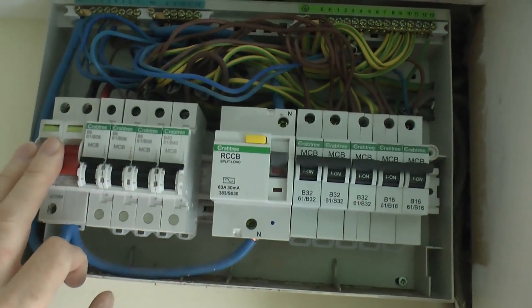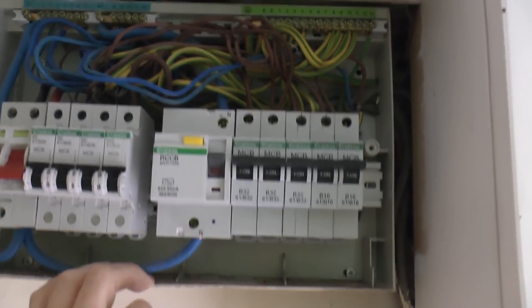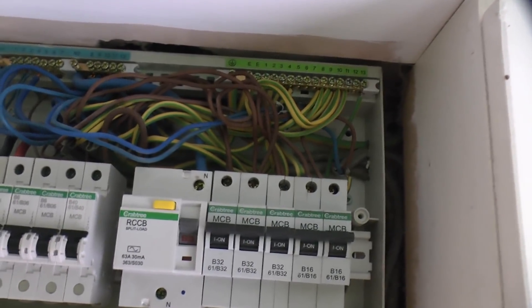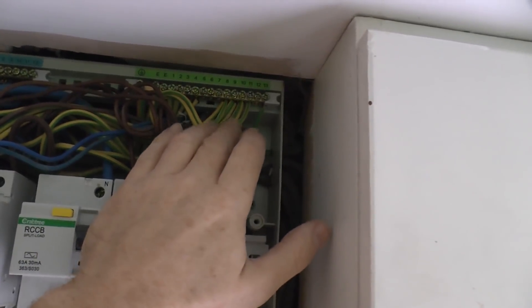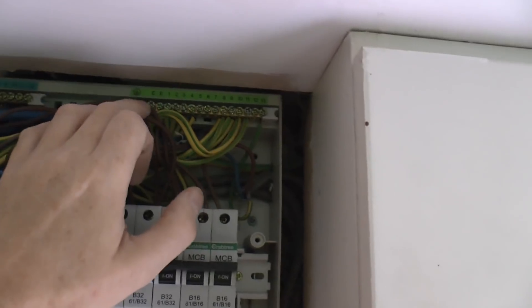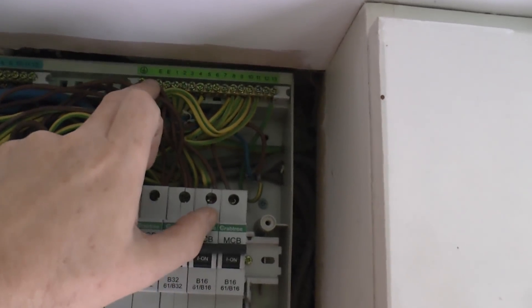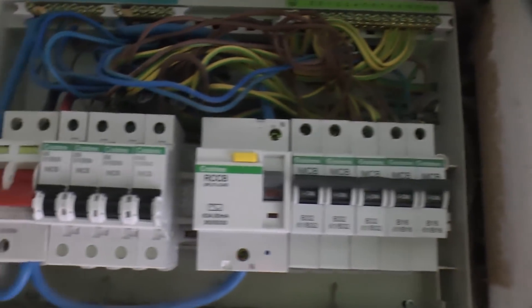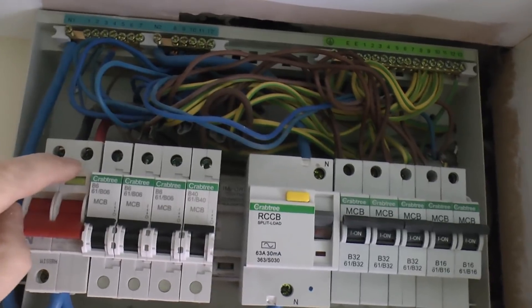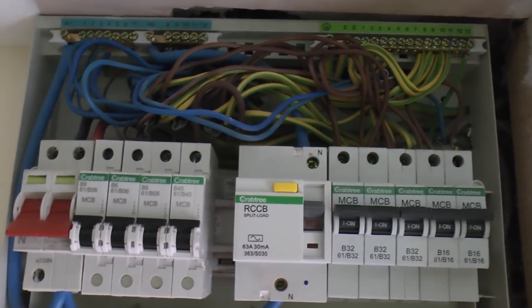So let's have a look at the consumer unit and how we're going to connect up there. Here's our consumer unit — I've turned off the power already. This is a Crabtree one with a concealed bus bar arrangement so these things just basically plug in. In the top there we can see the usual tangle of wires, fairly typical for most domestic installations. So if this was an actual earth electrode for this building, then there would be a wire up here connecting to that outside. But in this case there isn't, so hence we're using that long roll of wire instead. It would basically be: turn off the power, remove the wire from here which goes to the electrode — that end is then one of your test ends. And this is a two-wire test for loop impedance, so we're going to test between the incoming supply — that's inside that hole there where the red incoming tail goes in — and the end of that wire.